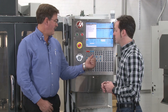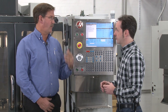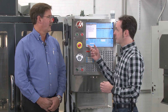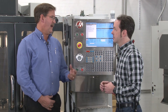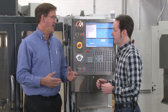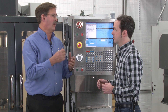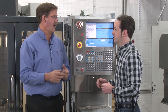To shut it down, first send everything home with 'power up, restart.' Before that, take the tool out of the spindle — it's good practice to remove the tool if there's not another shift following behind you. The machine works hard, and like people and horses, it sweats. If you leave the tool in there all night, over time the tapers on the tool and your spindle will develop slight rust spots and things that aren't good. So take the tool out every night and let it air dry.